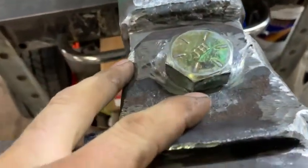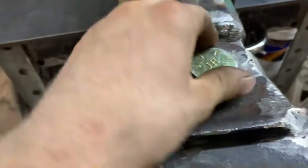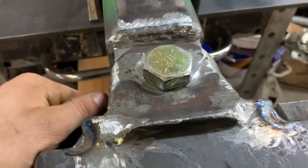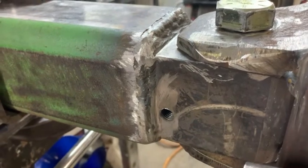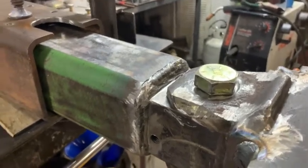This right here is the nut — one inch grade eight bolt. This nut is sunk in the thickness of the three eighths and welded all in there. I'm going to put a keeper in at some point — I'm probably going to drill a hole and tap it and put something offset that'll catch the notch of the bolt so it can never come loose. I'll tighten it to the tension I want and then put that keeper on, and if it ever wears a little I can snug that bolt up to keep vibration and slop down.